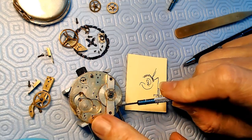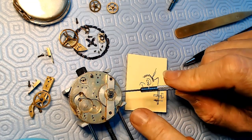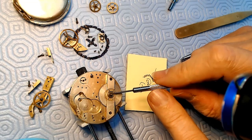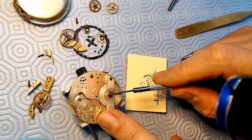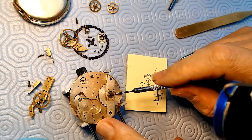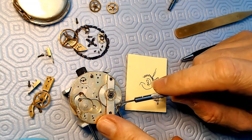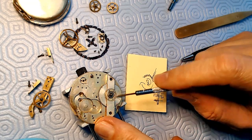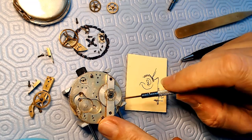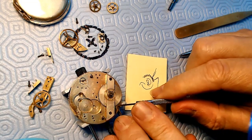I need to fashion this metal and somehow bend it at the right angle. I should probably leave this intact for the measurements so I can get the right dimensions. I do want to take out the mainspring to see what's going on with it. I think this thing just rides up and I can make the angle, then file it later until it fits perfectly. The strength of this spring has to be right - not too strong because it might ruin the teeth, and not too weak because it won't grab properly. It's going to be a tricky little part to make.